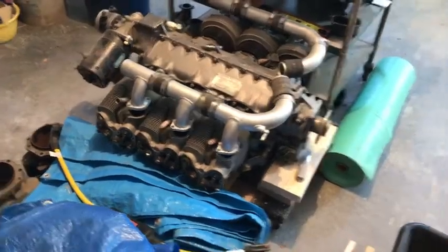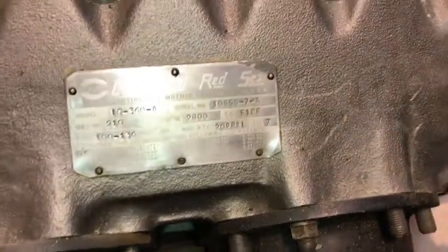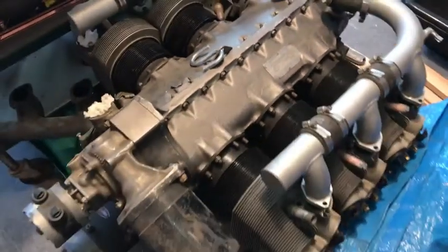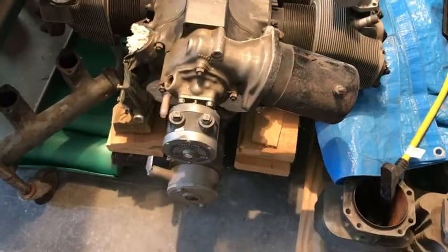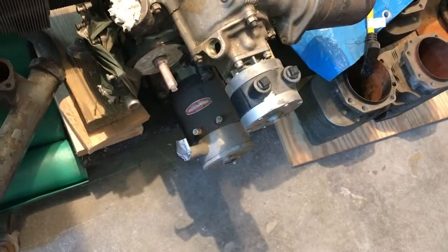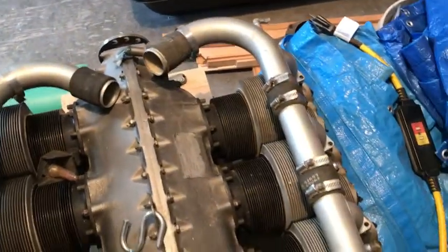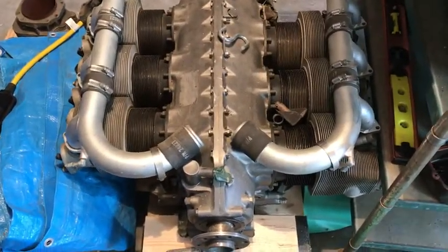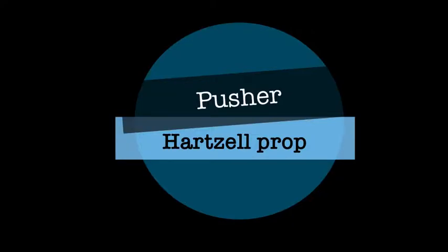For the Coot, we've got this Continental IO-360. That is the Continental IO-360 — it's a red seal, so I think it's been overhauled at one point. Obviously it doesn't look overhauled right now. It does have a vacuum pump, a starter, and an alternator down there, plus another takeoff for the mags. It's got the intakes. Upstairs I'll go up and video the rocker covers and the various pieces for this, plus the log book. This also comes with a pusher Hartzell prop that's new in the box.